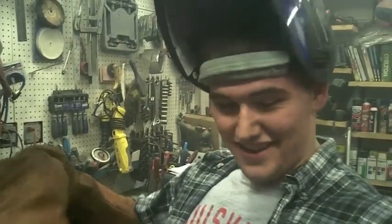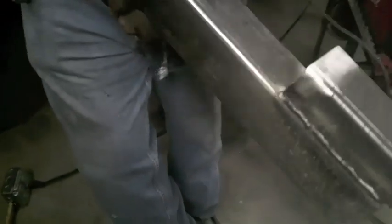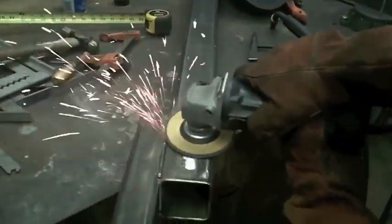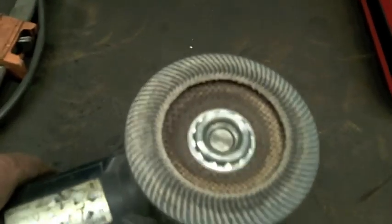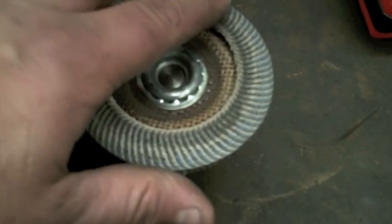Think it's time to invest in some new gloves? Yes! Go ahead and hit it with the angle grinder. Let me see if I can get a close-up — all those dots and bumps you see all over it, that's metal slag. That's the splatter that lands on the metal while it's still hot and actually sticks to it, leaving a dirty look. Now we angle grind that off using the sanding disc. This is what an angle grinder is — it spins a disc at high velocity with sandpaper laid sideways and glued together. It really does a good job of taking metal away.